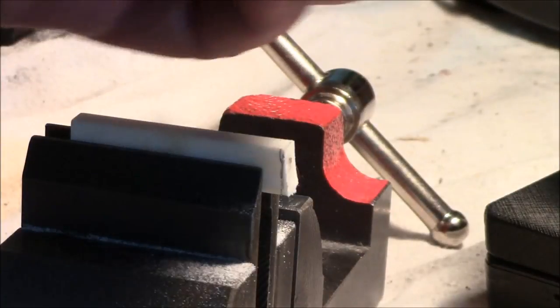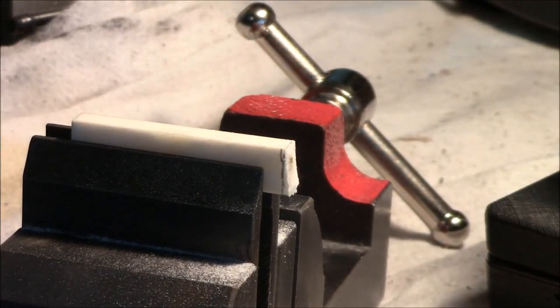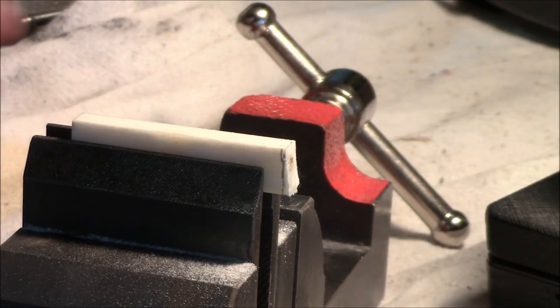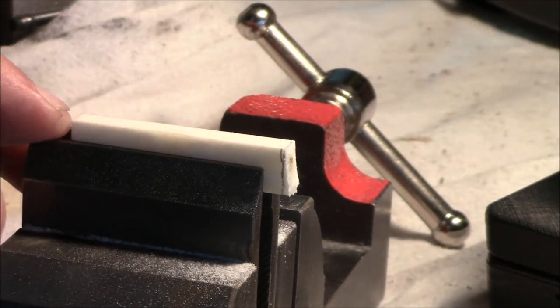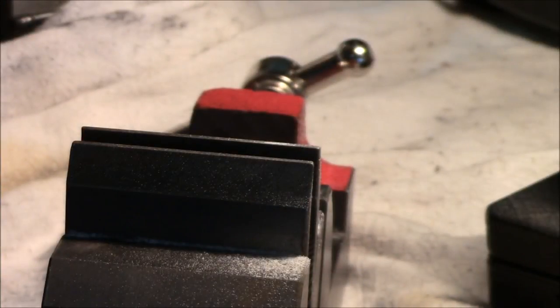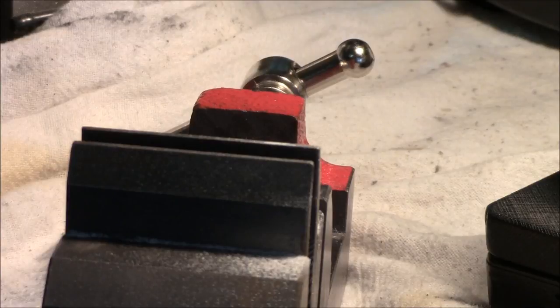And normally this would look nicer, okay? But anyway, I also keep these parts. I can grind these up and use them as paste to do repair work. All right. Now, the nut's been roughed in shape, and I'll get another fitting measurement on it with the guitar's body, okay? And like I said, once you cut it this close to the line, you can't cut it again because it'll just crack and chip on you.